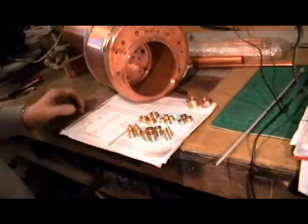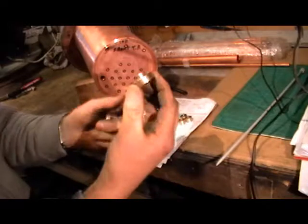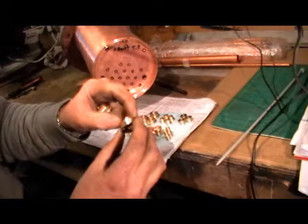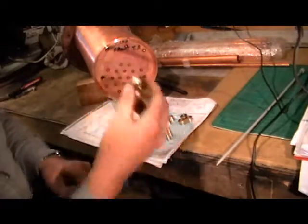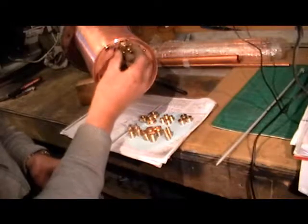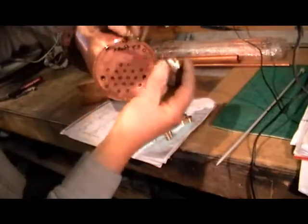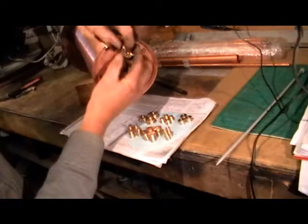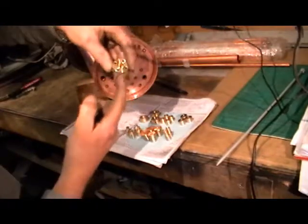While I was on my lathe as well, I managed to get the steam header bushes done. This one with the spigot goes into the front of the front plate like so, and that's silver soldered in. Then this piece is soldered to the steam pipes, which then bolts onto that. And the steam pipes are coming off here at 45 degrees.